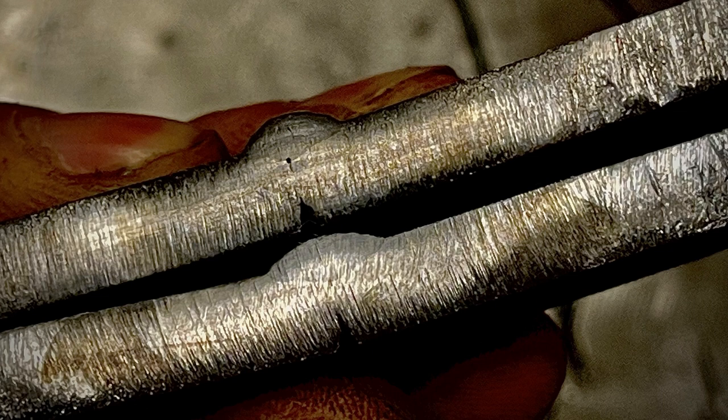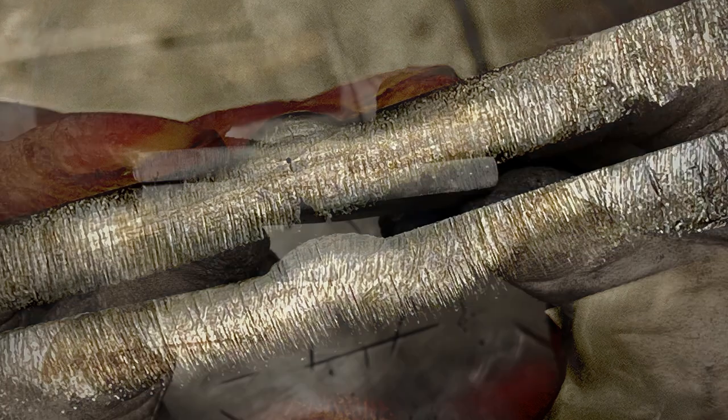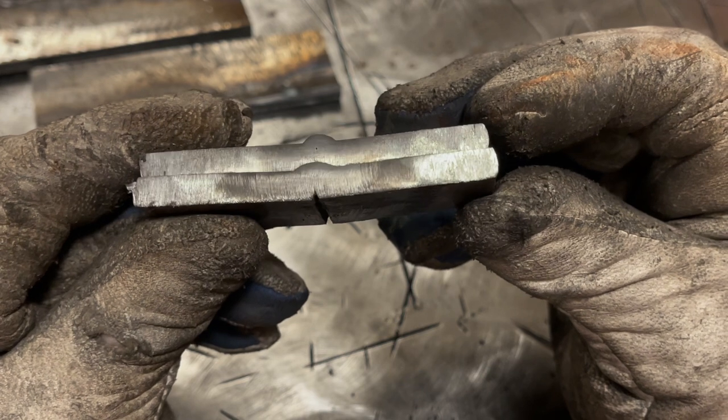So the pass out was run hotter, and this is the cutoff parts of the plates we broke. So the start, when I was running at, I believe, 90 amps, and then the end where I was at 120 amps. Now, the first inch that was run at 90 had very minimal penetration. The little dot that's below the weld is not porosity. It's just that the plates are curved, so it did not fuse there. If the plates were flat, you wouldn't see that, I guess. But again, a little bit roped up, not a whole lot of penetration.